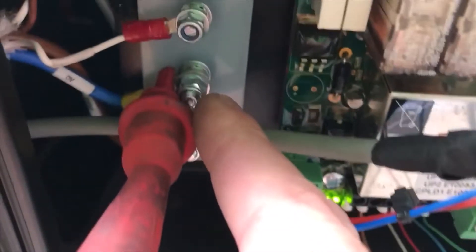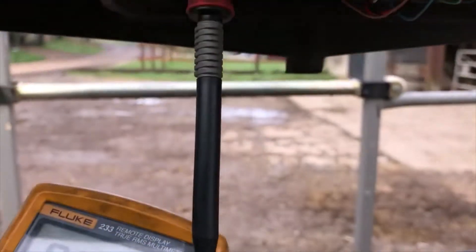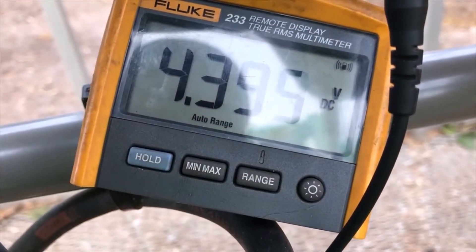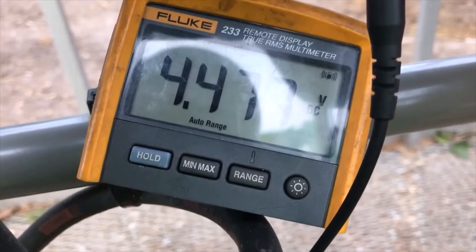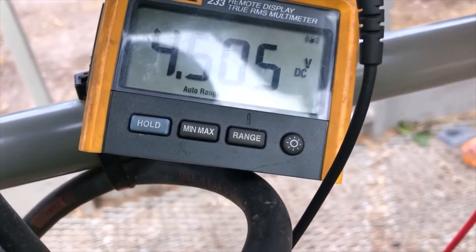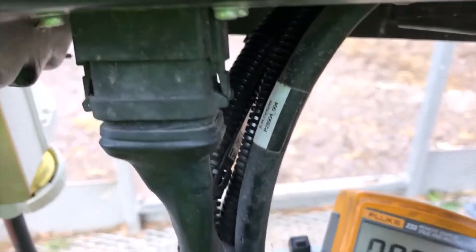I have this blue wire here as my ground reference. So my black meter probe on that, and the positive on the test point. So this is the voltage that I am measuring - I have 4.38 volts. So that's way too high. This is channel 1, and if I move this across here, that's channel 2, with 4.4 volts as well. So that's the voltage in the case - the old board is showing these high readings.